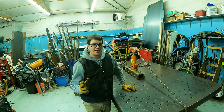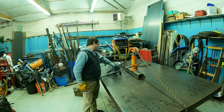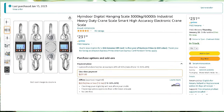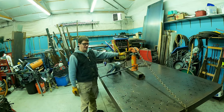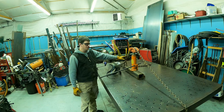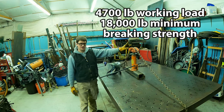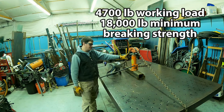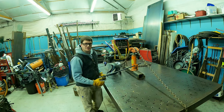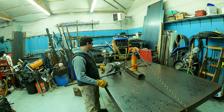A couple comments said I cooked them so they're not rated anymore, and I 100% agree they're not rated. But I'm so curious as to how much I affected them that I went and spent my own money. I bought this 6,000 pound crane scale. The hooks are rated to 6,200 pounds. The chain I have is 5/16 G70 — it's not 3/8, so it's rated to less than the 3/8 G70's 6,600 pounds.